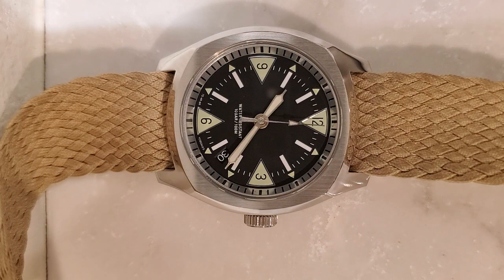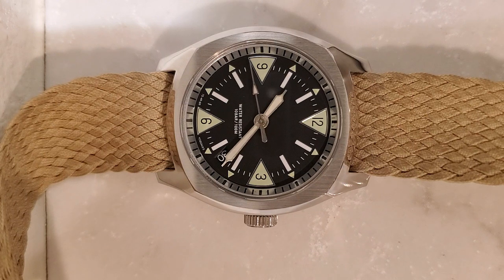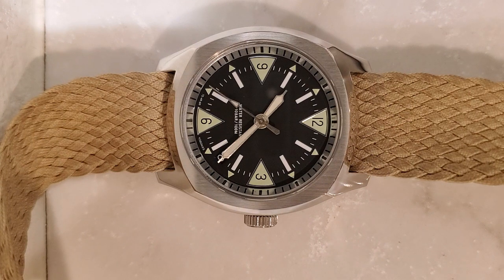That is the completed build here. We've got it on a hyperlapse just so you can see the second hand go around and watch the hands move a bit. When it comes to total assembly time, I would say it's around two hours — that includes setting the hands, pressing the crystal and chapter ring, cutting the stem down for the crown, screwing everything together, case back, gaskets, and whatnot. It definitely is a lot easier than I thought. There are just a few components you're putting together — it's not like we're building the movement from scratch, it's more of an assembly. It's a very cool project and I'll do it again — I think I'm going to do a diver next, so stay tuned.